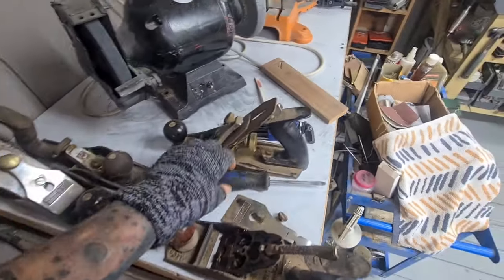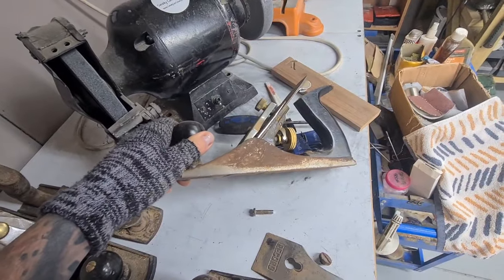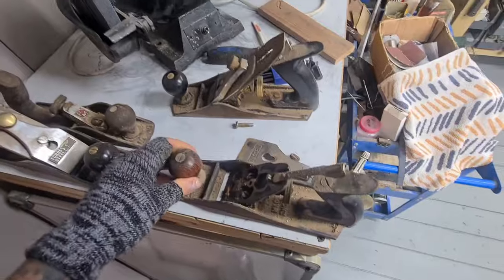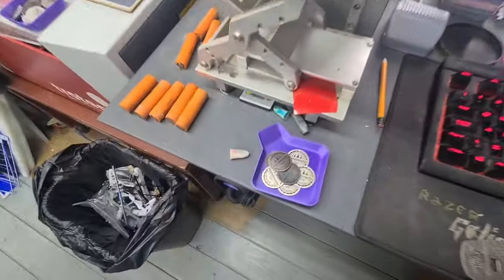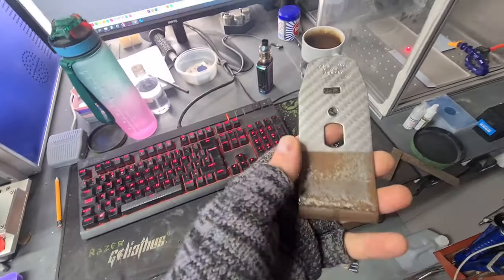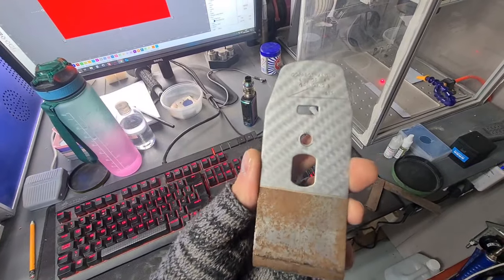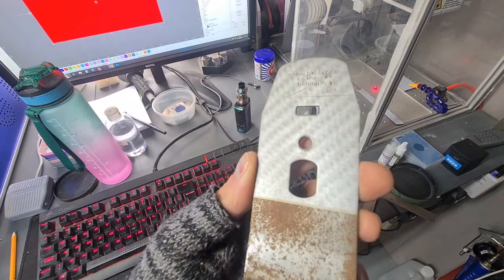All these hand planes, as you can see, where they've just been sat in the workshop over winter — they are not in their best shape. One thing people don't always realize with fiber lasers is they're great for marking, but they can also be used for rust removal. This one's been run through just at that end to show you — it's stripped all the rust back to nice clean metal.